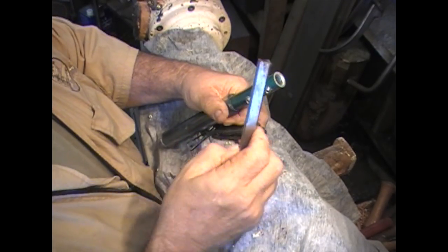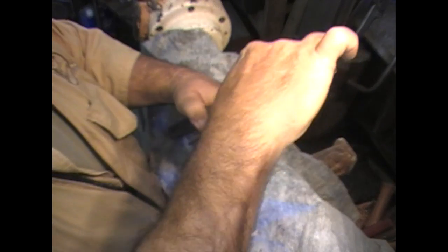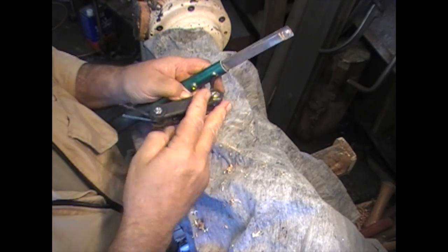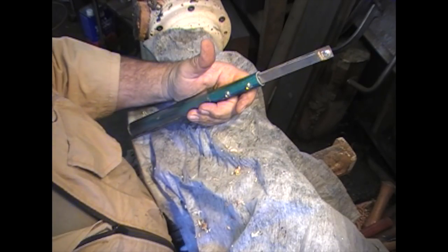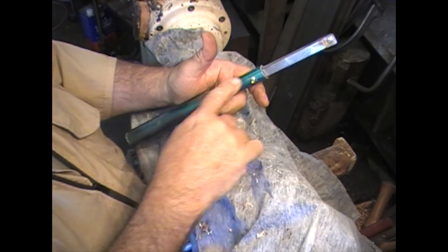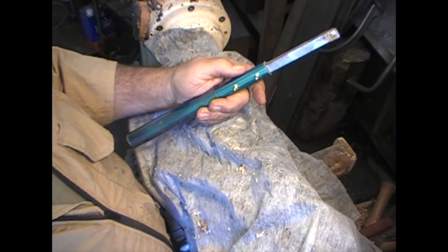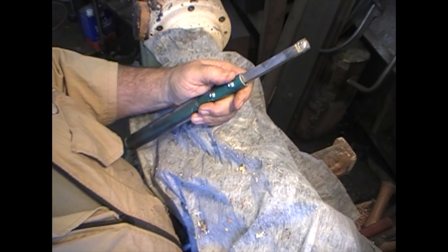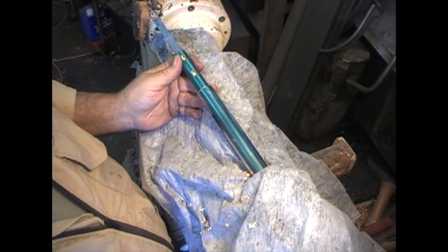He softened the four corners — one pass on the grinder did it. Then he puts the cutter in the rig and tightens it up. You don't have to over-tighten it — that's the problem, you'll strip out the aluminum. You can also use lightweight steel pipe. When you're at the hardware store, find a 12-inch nipple and cut the threads off each end to get the right pipe size. If it's a little bit loose, it doesn't hurt to squirt a little adhesive down in there, set it, and let it cure a couple of days. This is a very short version of the R2 cutter bar, and I like it.